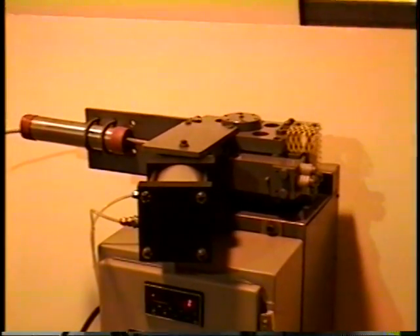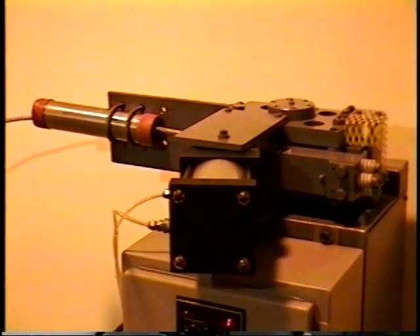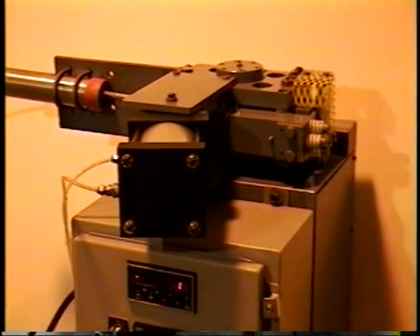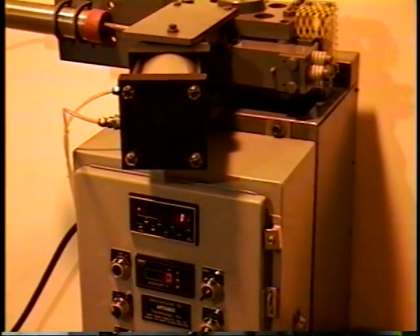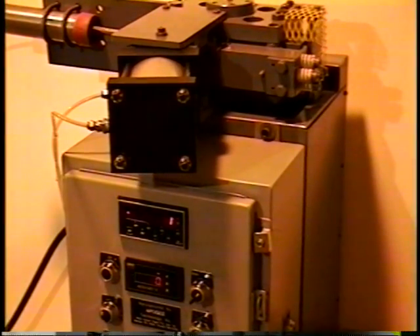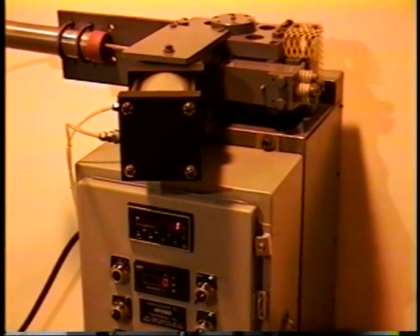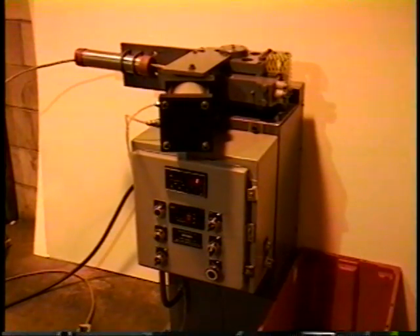That frame contains the bearings and the drive and driven rolls to feed rod — three-eighths inch diameter redraw rod, in this case — through the feeder. Most importantly, it is powered by a one horsepower DC motor through an axial spur gear box, so we don't have the transmission losses normally encountered with a right-angle drive. This one uses an in-line gearbox which has approximately 83% mechanical transfer efficiency, as opposed to somewhere in the 30% range for right-angle worm gear drive boxes.